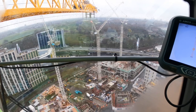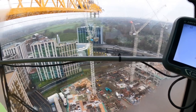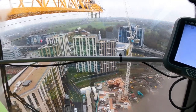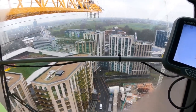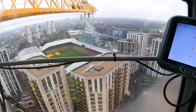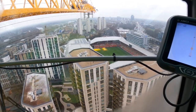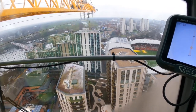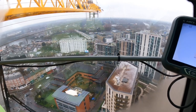One feature these cranes have is a system where they can't do a full continuous 360-degree spin. They only go to about two and a half turns and then stop — you've got to go back the other way. That's due to the power cables running up through the slew ring. You can get a system put in place — a lot of the older cranes tend to have them — where you can spin around freely. So I've gone down to pick something up and I can't get it; I've got to go back around to my left, which will give you a nice POV anyway.